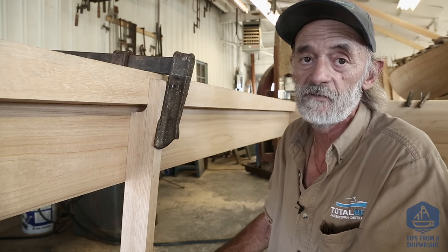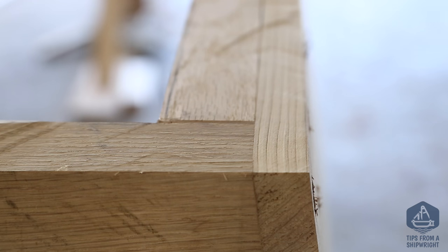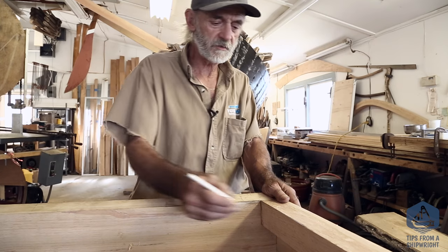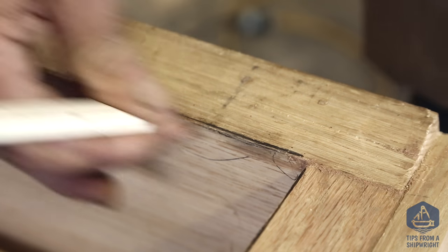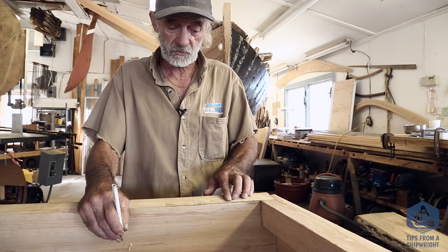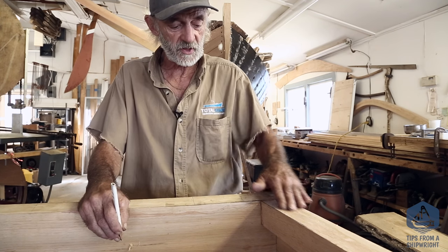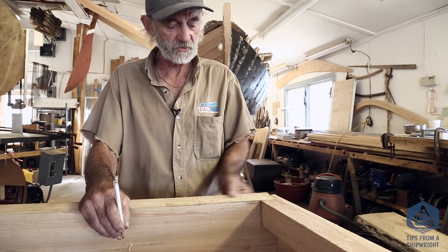The next thing I'd like to do is go aft and show you a little bit about how we're fairing out the corner of the transom, the chine log, and the side plank. You can see I've dubbed down the outboard end of the transom and the aft end of the chine log and side plank to be nice and flush with each other. Now over on the starboard side, I'm going to take a pencil and draw a line on the very bottom edge inboard of the chine log and on the inboard edge of the transom. That's a control line — I'm going to flush this corner off and dub it down like I did on the other side, but I'm not going to remove any of that pencil line, because that's the very control spot. We don't wish to change the shape of the boat — just flatten it off by removing material off the outboard edge of the chine and transom.